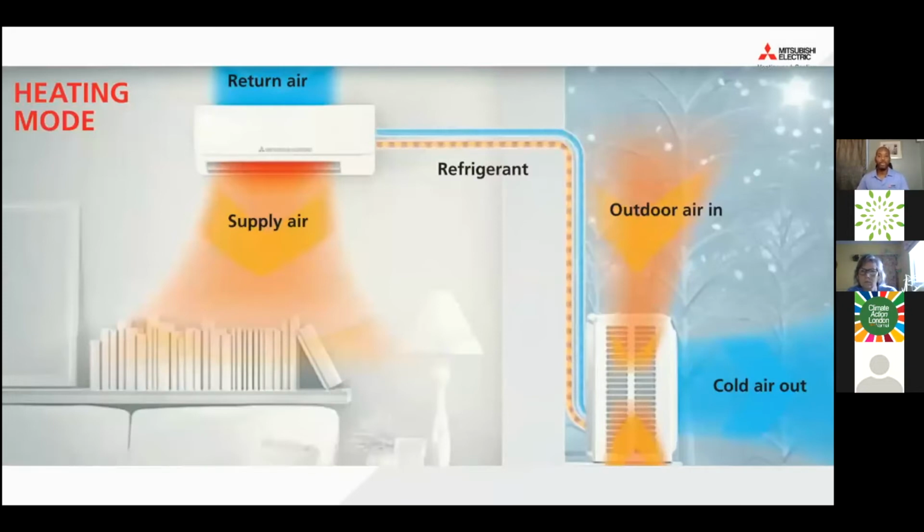As I mentioned, heat pumps use a refrigeration cycle, except that it also works in reverse. It has something called a reversing valve. Of course, they couldn't come up with a more original name. It lets you change which space the heat is being absorbed from. So how does the heat pump produce heat in the winter? You're saying it's cold outside, but yet I'm getting heat inside. How does that work? There's actual heat in the air until absolute zero, which is on the Kelvin scale, but we would look at it as negative 273.15 Celsius. Once you get down to that level, everything stops moving, all molecular action stops, it's the end of the world. But above that, there is always some heat in the air. Using the refrigeration cycle, heat pumps are able to extract some of this heat energy, concentrate it, and then transfer it to the inside.